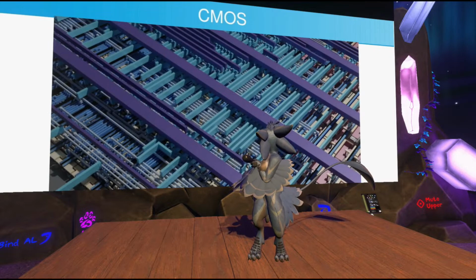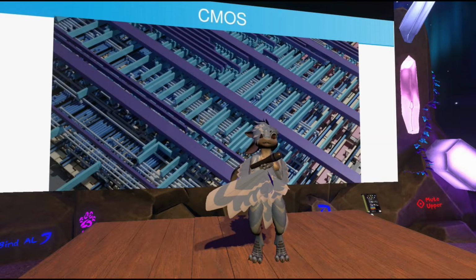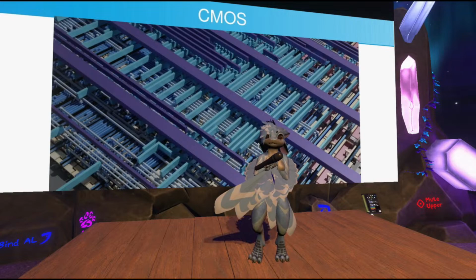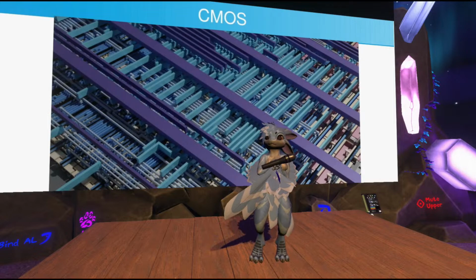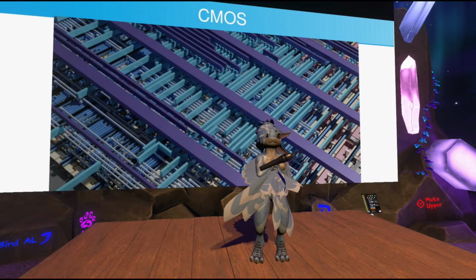At the very bottom, if you look very close, you can see some red and yellow, which are the different types of silicon for the transistors, among other things. And above that, it's just a really large amount of wiring, connecting all of the different transistors together. It's very similar to a PCB, actually, in the sense that you have these traces going across with vias dropping down vertically to make connections on the vertical axis. The funniest way to imagine it is if you have a four-layer printed circuit board that has nothing on it except SMD transistors, and you flip that around so the transistors are at the bottom, and you essentially get a really, really crude model of what's going on inside an integrated circuit.